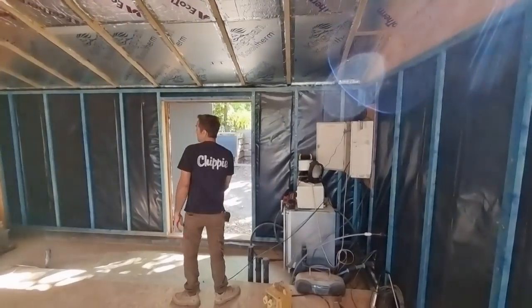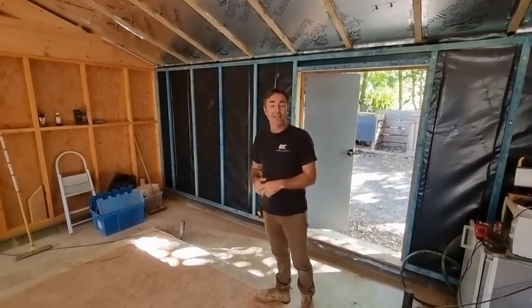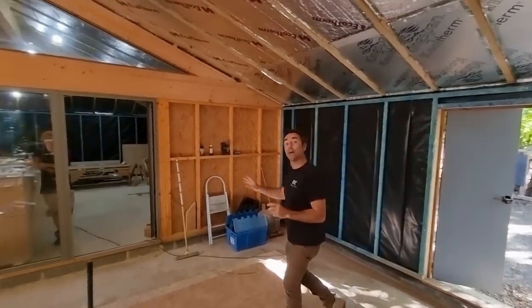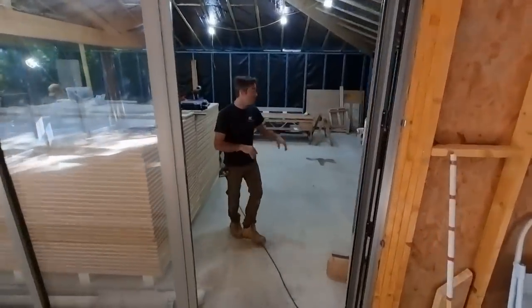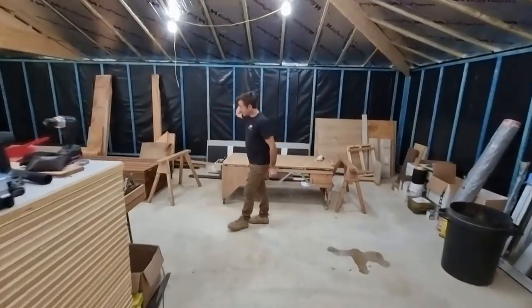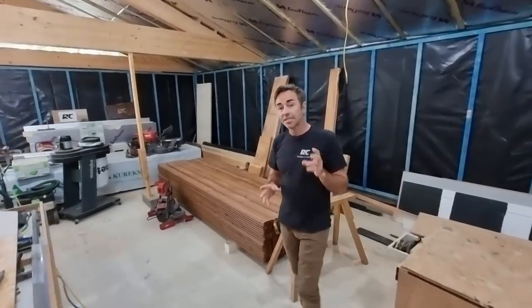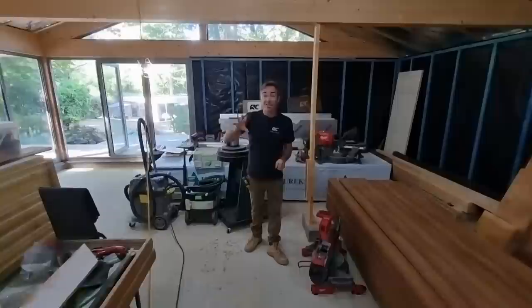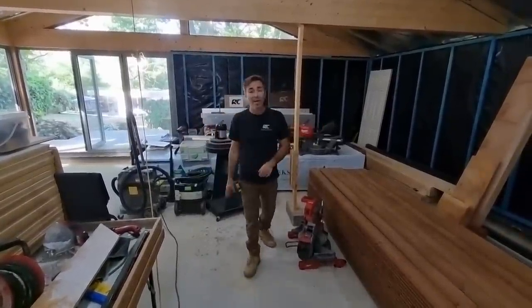The plant room wall travels across the back here, and the OSB goes on the inside to give us some grounds to fix to. So it'll be the ceiling, then the wall, then we're going to drop in the other side and start our stud work. The stud work forms little areas like a small changing room - the sort of normal thing you might have in a garden room. We've got a new type of stud work here as well that I'm really excited to show you, but you'll have to check for that video in the future.